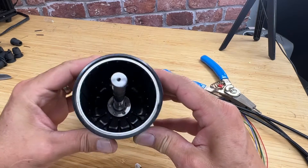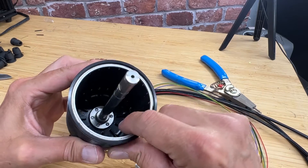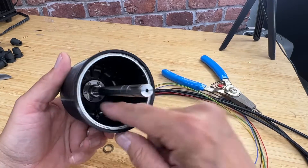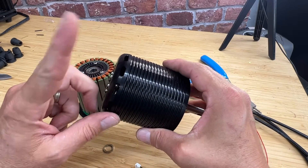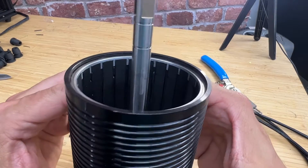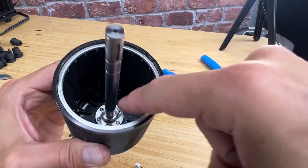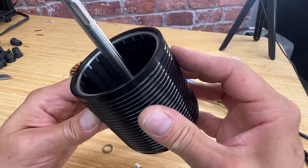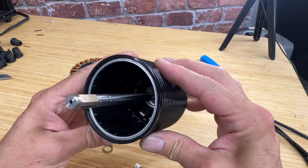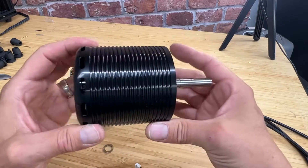You can see the connection down there for the six screws — it's extremely strong. And you can also see in the bottom of the bell there some fins. As the rotor spins, those fins force air to the outside and through these holes, so it's a centrifugal fan. You can also see that the magnets are held in place by this machined ring on the top and bottom, so they stay perfectly aligned and they're not going to go anywhere — they don't need to be coated with a ton of epoxy. And as I mentioned, this is that one-piece 7075 super strong aluminum shell.